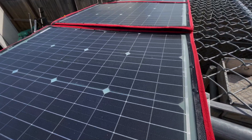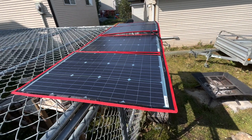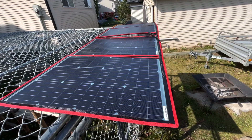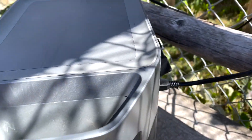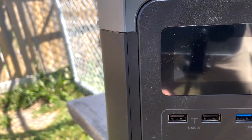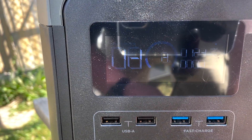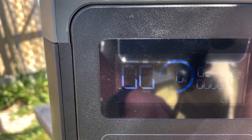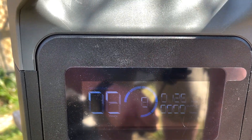Over the past little while I've been experimenting with this 220 watt panel. I haven't come anywhere close to seeing that rated power because I've just been laying it flat, but I've been getting about 130 to 140 watts when the sunlight is good. As far as being paired with the EcoFlow Delta, I think I have it dialed in — if conditions are good, I shouldn't have to worry about power. Hope you enjoyed the video; post any questions or comments below.